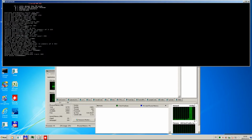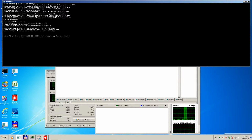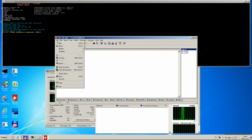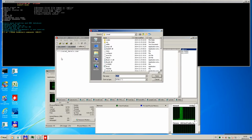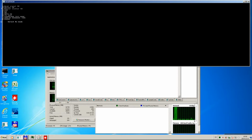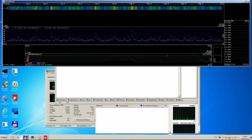And now I stop here and go to the main menu, press 1 for the first file that is named in AD file. And that is 1. Oops. I placed this file in the wrong directory. Save as. Linrad BladeRF. Save. And then 1. And I want to run in FM mode, E. And I don't want to repeat this. And here we are. And I listen to the same station that we listened to before.